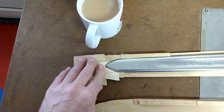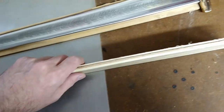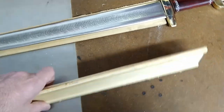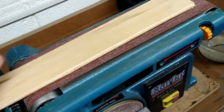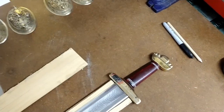Just put plenty of glue on, tight fit, clamp it all up and leave it. What I did with this one - because one thickness wasn't quite enough for the sword blade - I stuck one solid one on and then a second one, but then I took this surface and belt sanded it. So I basically glued two on, then that was too thick, so I just sanded off a surface on the belt sander, kept matching it to the sword blade until it just covered the blade with a little bit of room.